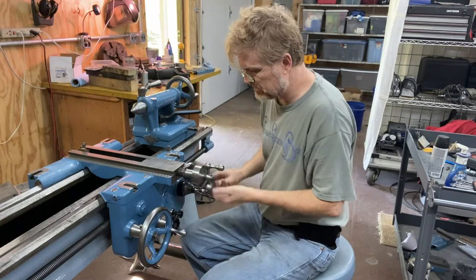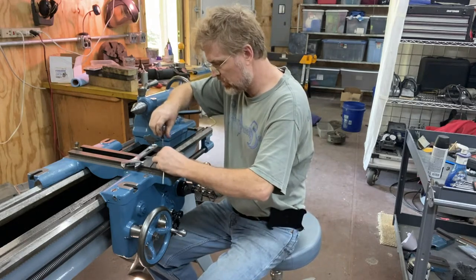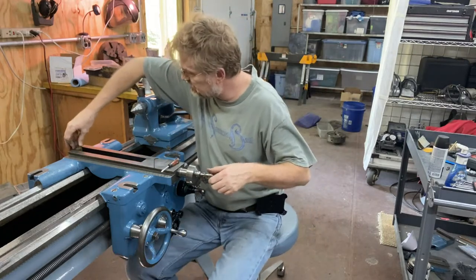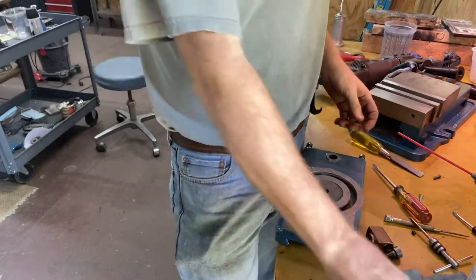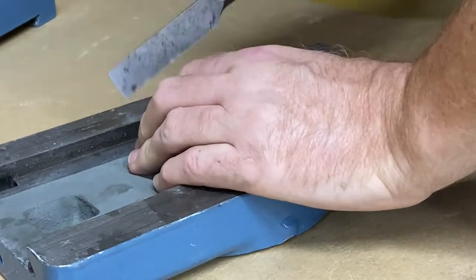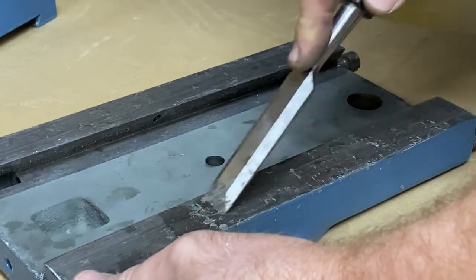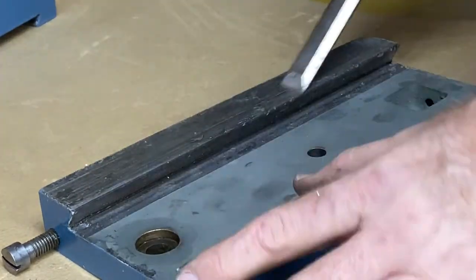I think it wasn't meshing with the gears — I got it meshed now so it's going in easily. There's a fine little screw here which I'm pretty sure is an oil access port. The nut goes in the cross slide piece first. I've previously scraped that piece for flatness. The next thing I want to work on is this compound — there's a lot of clear coat stuff that's gotten picked up on the ways here on the bottom. I may try to scrape in these ways; they're small enough to fit on my reference block. I don't think these things come with way wipers — I think that might be an upgrade. I'll do several long scrape marks on there to help retain oil.